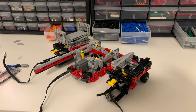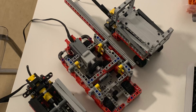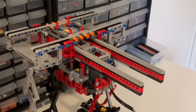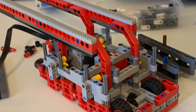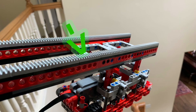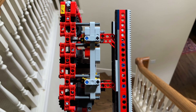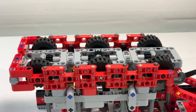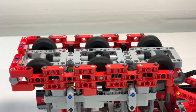After finishing the feet, I added this small gray platform on top of the lifts, which would be a good level foundation on which to build the rest of the robot. I started working on the middle section. Using Technic bricks, I first constructed these two large beams with gear teeth on top, then built up the middle. This section has six-wheel drive and due to a high gear ratio, it can spin pretty fast and move the robot pretty quickly.